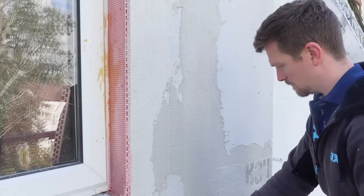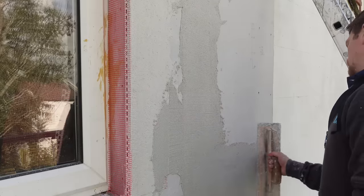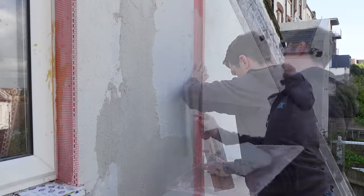Because of that gap, we need to put an extra layer of protection — just like we scrim tape the joints on plasterboard, we're doing the same here. We're just going to cut 100mm slivers, put them in place, and then cover them up.